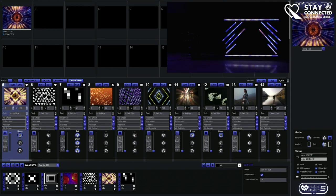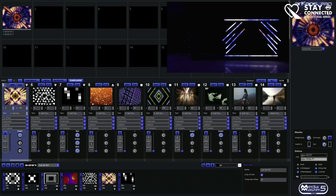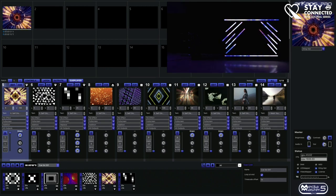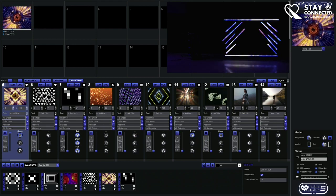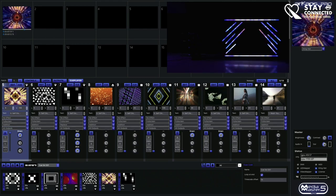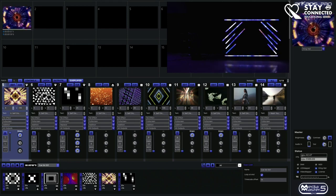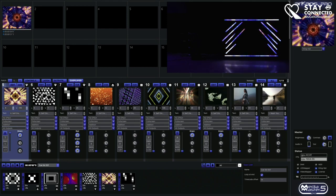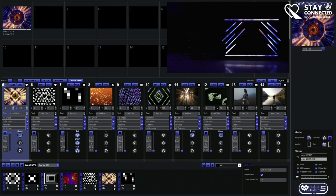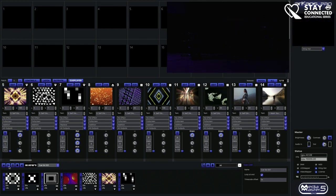You can see just to the left of it, the actual display being shown. So that's where we were saying the canvas size is key to the overall quality of the picture. If our canvas size stayed the way I had it previously, where it was 300 width, and we would have had half that side blank, you wouldn't see this center section of the image in the center of the actual LEDs themselves, or the pixels themselves. So you can see that orange is playing in the center of the two bars meeting, as well as the content. So I'm going to show you a couple more videos that we have set up here.